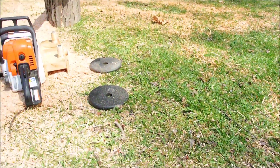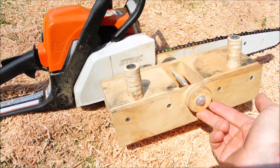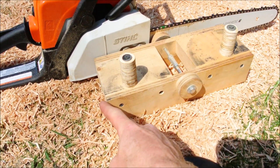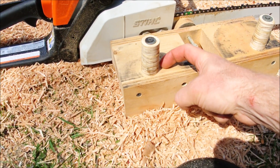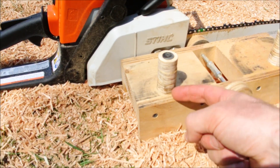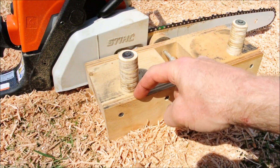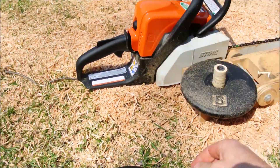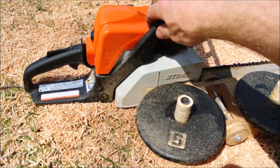But I made an even better refinement. Check this out. What these are is just a big long three-and-a-half-inch screw located at two inches in from the end and one and an eighth of an inch from the side — that's the center of the screw. These are just hole-saw cutouts from three-quarter-inch plywood. There are three of them, glued together, and you screw right through the pilot — it makes a really nice stable mount. Then five pounds of weight on each side gives ten pounds total, which offsets the weight of the saw.